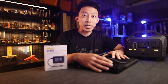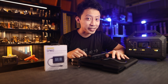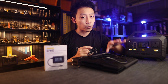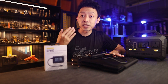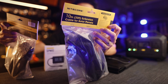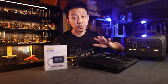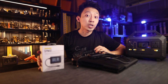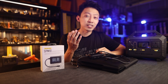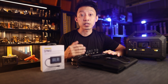That's basically everything you need to power your gear outdoors and keep it running for extended periods with solar power — literally free and unlimited as long as you have good weather and sunlight. Start with one power station and one solar panel. If you're serious, upgrade to two or three solar panels with parallel cables and 10-meter extension cables so you can keep the power station in the shade and the panels in the sun. You can add solar controllers and more power stations — it's all up to you.